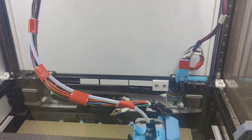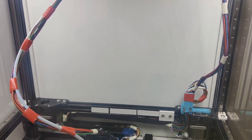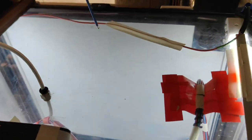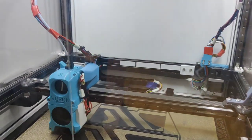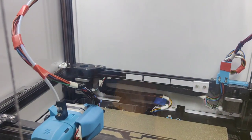Looking at how this cable chain works, this internal cable chain only needs to be for the X and Y motors. I can remove this umbilical because at the moment the cable goes here and then all the way up. This chain needs to go all the way up to the roof, then run along the roof to here and then it becomes umbilical. I can do that by using the XY chain, mounting it at the back of the printer in front of the thing to the very top. Then I'm going to separate out the AB motors and use them in the existing chain that's there now, but I'll probably use the other chain because it's a bit smaller, and we'll see how we go from there. Worst case scenario, I can put all the cables on the outside of the machine because they're just running the umbilical. So that's something to think about.